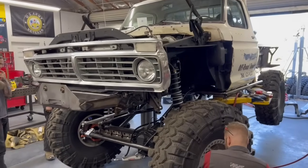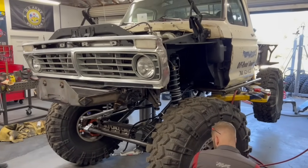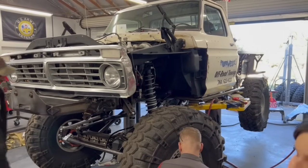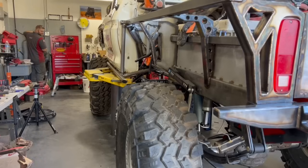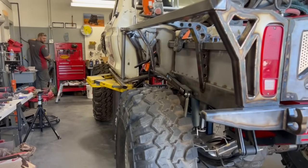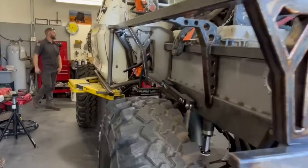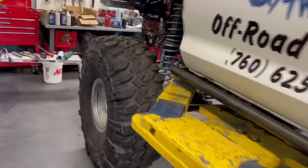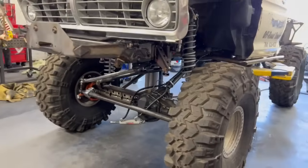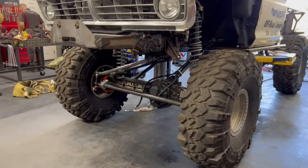Hey, it's me, Future Jenna, again. Just wanted to let you know that these shocks leak so bad. We didn't find out until after we left the shop, but they all leak at the top hat, both sides, and they're brand new Fox shocks. It led to a pain for Alex and I of having multiple rebuilds done on them, multiple people going inside of the shocks, one person actually honing the inside of the shock to get it to stop leaking because there were some imperfections from the factory. Anyways, we're good now, so back to past Jenna.